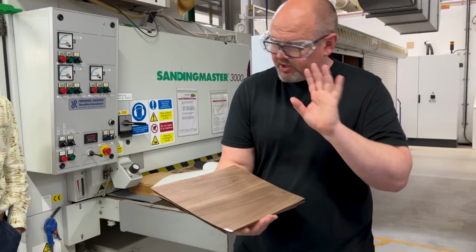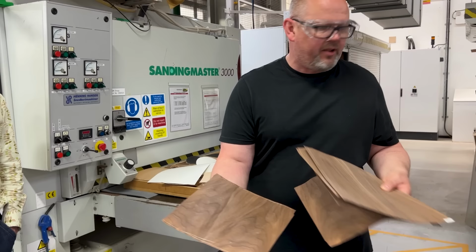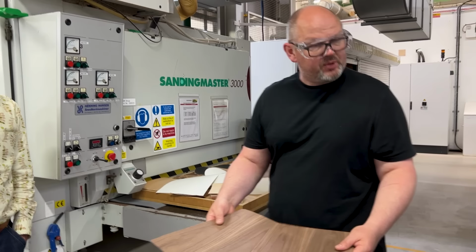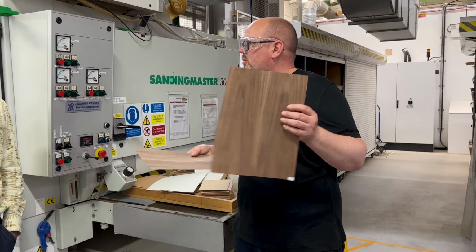Clearly, if we supplied a pair of walnut loudspeakers to you like that, technically that's correct, they're both walnut loudspeakers, you'd be quite disturbed about that. So our walnut veneers are what we call bookmatched. So as you go through it, you can see the grain orientations lining up perfectly. Of course the idea notionally of a bookmatch is simply like that, straightforward. What that means is, the walnut loudspeakers are born as pairs, and they go around the whole factory together as pairs, and you can see them all the way around travelling together. It also means, should we be unfortunate, and we have a manufacturing incident, and one of them gets damaged, they're both damaged, because they're unique figuring, unique grain.